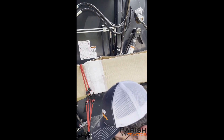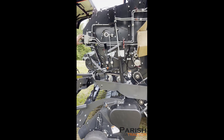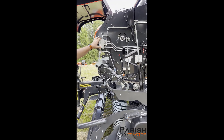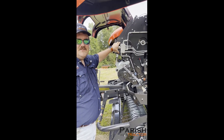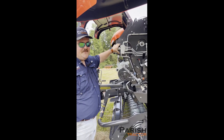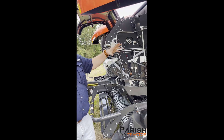The great thing about this baler is it's designed for wet or dry hay. With that you get a proportion valve — a lot of balers have that. Kubota does a proportional valve that is controlled from the seat of the tractor. You can change your core densities all the way to your middle densities and your outer densities.